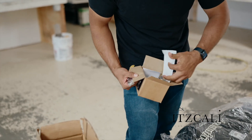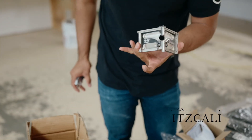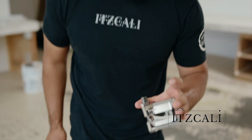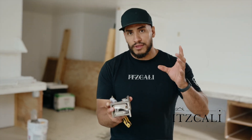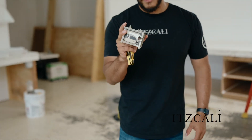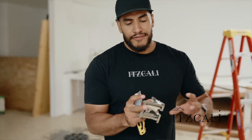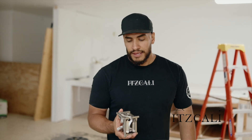Look at this — it's a three and a half angle. So this is the one we're going to start coating with. We're going to start doing taping with the three inch and then coating with the three and a half. The reason why I wanted to go with the bigger one — I was asking Aaron about it — is because I feel like the little one, if the framing is a little bit out of whack, it's not working as great. But with the bigger one it definitely will. And it's also better because it's going to cover all the screws so you're not having to go over those screws. You can just pretty much coat them all.